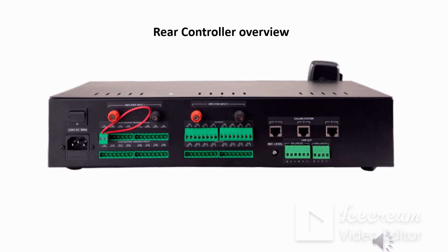Continuing to the left, you can see 16 fire trigger inputs. The first 15 trigger terminals can be utilized for 1-to-1 mapping — trigger 1 for zone output 1, trigger 2 for zone output 2, and so on up to trigger 15 for zone output 15. Trigger number 16 is an all-trigger input, meaning if a trigger comes in on the 16th input, all zones will be triggered simultaneously. Above that is the amplifier 1 terminal.